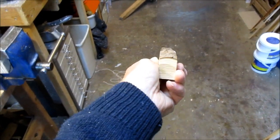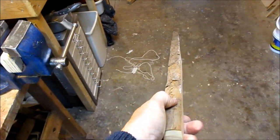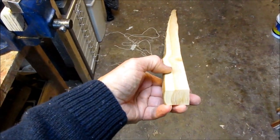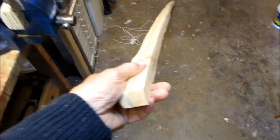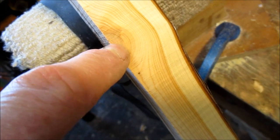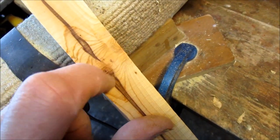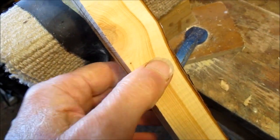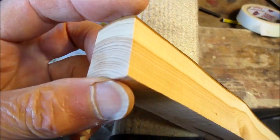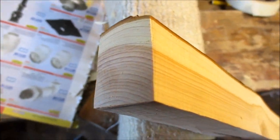It's all about proportion. It's still a bit straight on this edge here, but still got an inch of tip width. We're getting there, and now you can see I can do a second cut getting the thickness into size. What's really nice though is you can see how this knot is beginning to disappear. So with any luck, by the time this is narrowed to proper final flight bow dimensions that will have disappeared, and the sapwood will all be looking a lot thinner. I may thin it a little near the tips, but I want to try and keep it whole if possible.